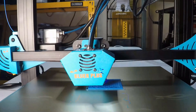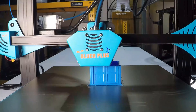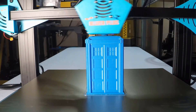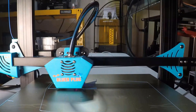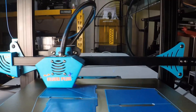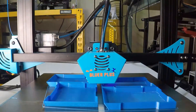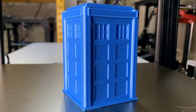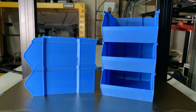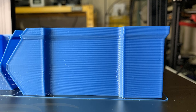Finally, I will speed up the printer to 200% of the print speed, which is 80mm per second. I tried to print a larger pen holder and some stackable boxes. The extrusion is as good as it was when printing at normal speed — it can keep up with this slightly greater speed without any under-extrusion. These 5 boxes took less than 8 hours to print, with around 1.5 hours each. It wasn't super fast, but the print quality and speed are well balanced.